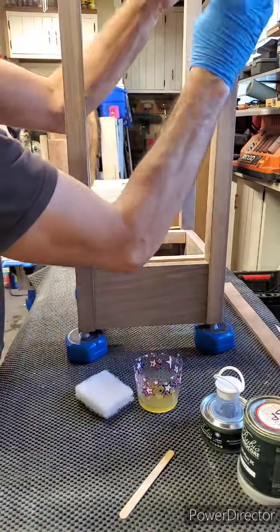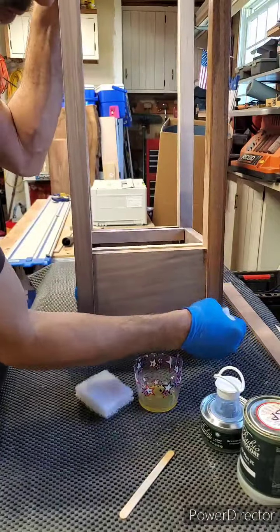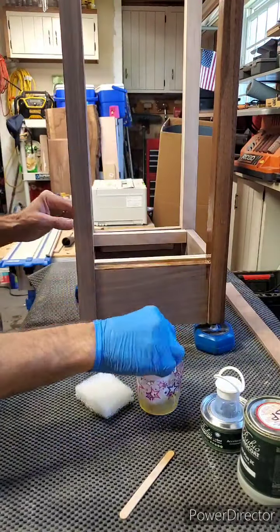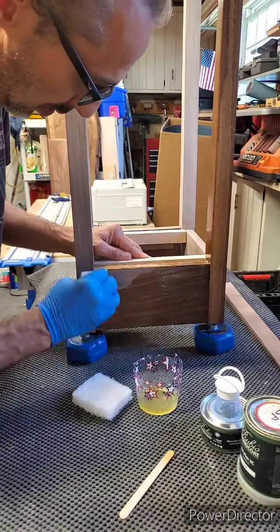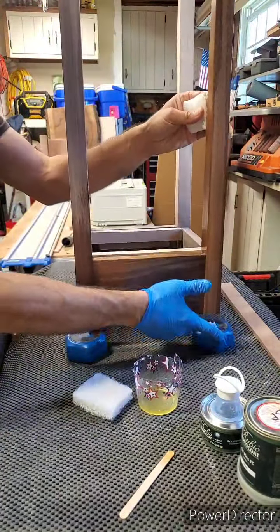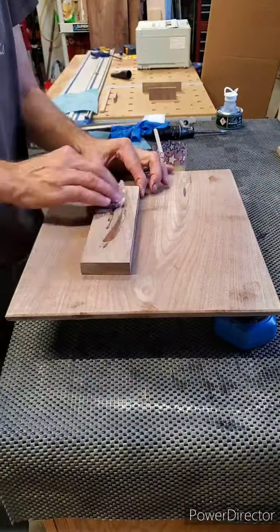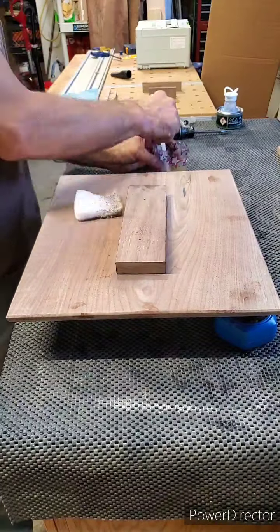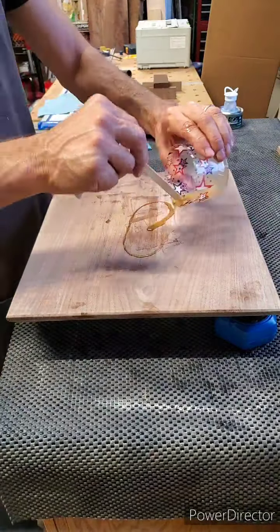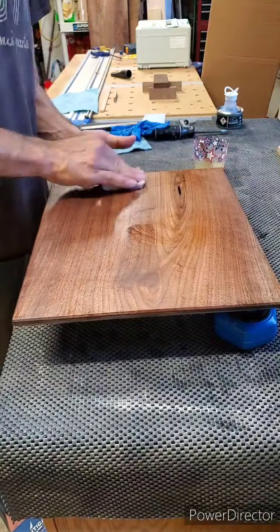I'm not going to go into detail on the finishing, but with all of the oil wax finishes, you just rub it into the wood until the pores are saturated, then wipe it all off and let it dry, and repeat the process if you want a second coat. If you want a detailed step-by-step on how to apply a hard oil finish, I'll link some of my other finishing videos in the description. The best tip for the hard oil finish is you can't wipe too much off after you apply it — if you leave a little too much on and don't get it all off, it leaves a sticky, hazy-looking mess behind. So it's best to wipe as much as you can off once you apply it and it saturates.